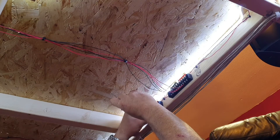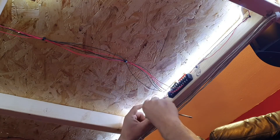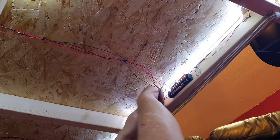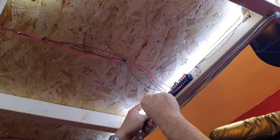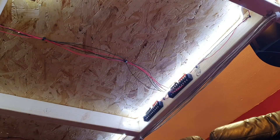So there you go - that's now going into pin 6 on the red one. Then what I usually do is I tuck it behind, tape it there, get the red wire there, put it down a little bit, lay it over the black one so it's nice and neat and out of the way. Then you just do the same again with the black - just find the end of this one.